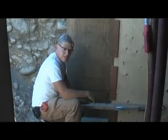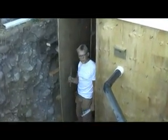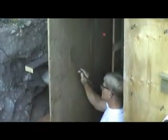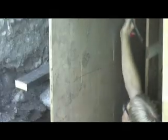So, next step. Awkward little spot, but I'm putting in snap ties. I wanted you to see how they go in place. There's nothing to them. We did our saw cuts, which you can barely see here, but these are saw cuts at this point. So, all there is for putting this style snap tie in place is feed them through the cut mark. You've got stops right here.